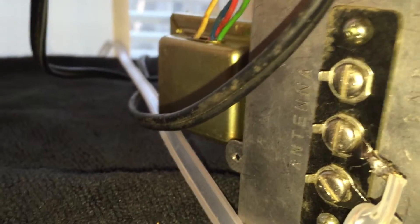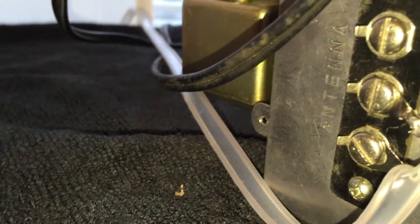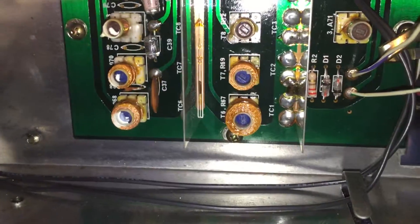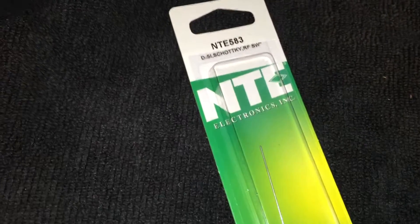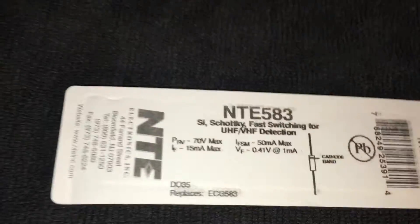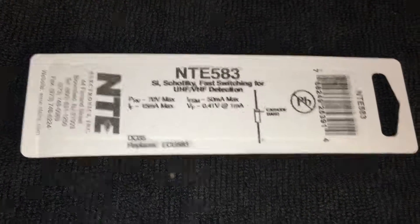I just had bare wires connecting to an outdoor long wire antenna, and I remember experiencing some static discharge when I touched the antenna connection. So I think maybe some static buildup affected these two probably rather sensitive diodes. These are germanium diodes. I wasn't able to get exact replacements — germanium diodes are pretty difficult to get — so after doing some research online I got these Schottky RF switch diodes. I wish I had germanium but I'll probably have to order them. I'm going to try these since they were available at Fry's today.